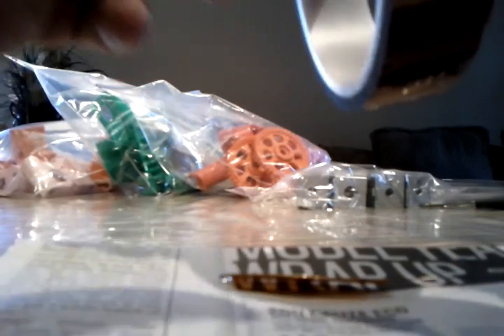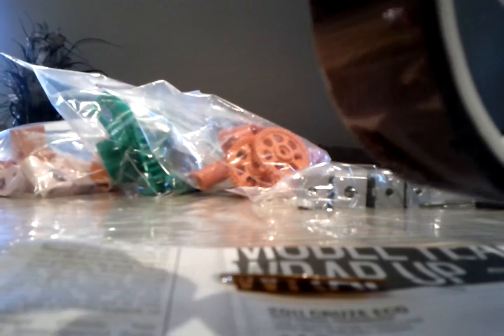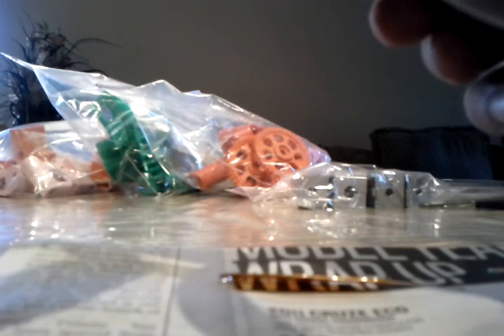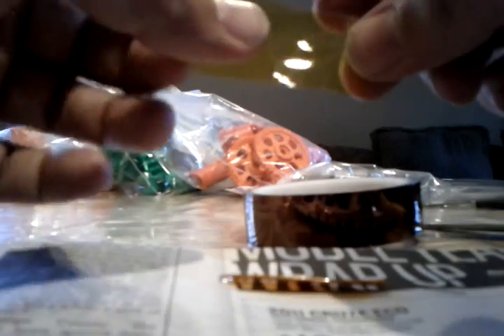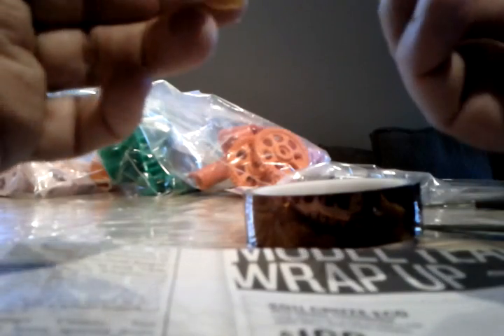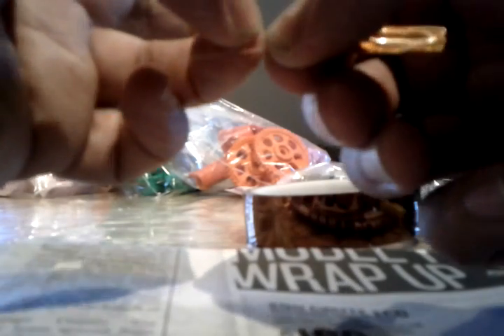One more. You want to leave the very end of the copper wires exposed so that you can crimp on a barrel connector there, or if you're going to solder it directly to some wires. I prefer the barrel connectors myself, but some may not have that many resources available. I'm actually going to separate these just a hair — better safe than sorry.